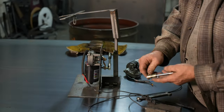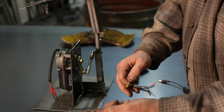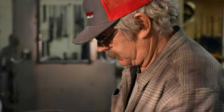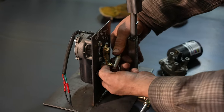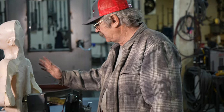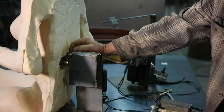Then we come down to our linkage. We run two styles of linkage. This particular one comes apart — if something gets caught up in there, you can pull that little spring back and pull that little knob out, then clean it out. This other linkage is a solid linkage — if clothes get wrapped up in it, you're going to have to take the nuts off and clean the linkage out. This particular style also has a cover plate on it, so if hair or clothes get down in there and tie it up, the first thing you want to do is pull the nut off the back.